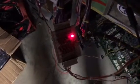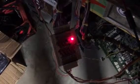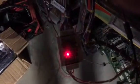And the next test is solenoid test. So it's going to go through all 16 regular solenoids plus the 6 special solenoids. And when it gets to the coin door lockout solenoid, that'll turn off. Now we're into the special solenoids. And the special solenoids are also switch controlled, so I can rake the connector with a ground wire, and we can see those turn on also. 2, 3, 4, 5, 6. So those are all your special solenoids turning on.